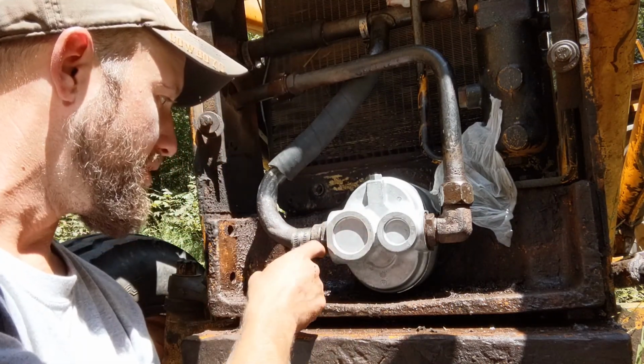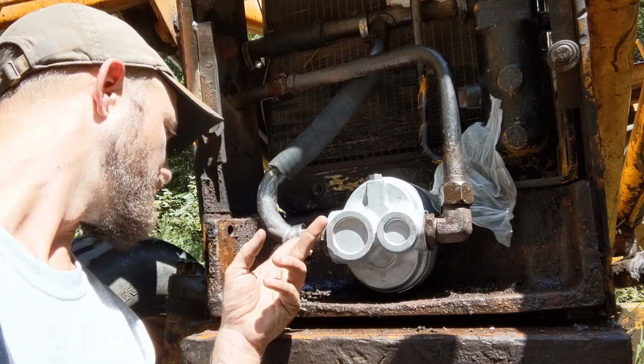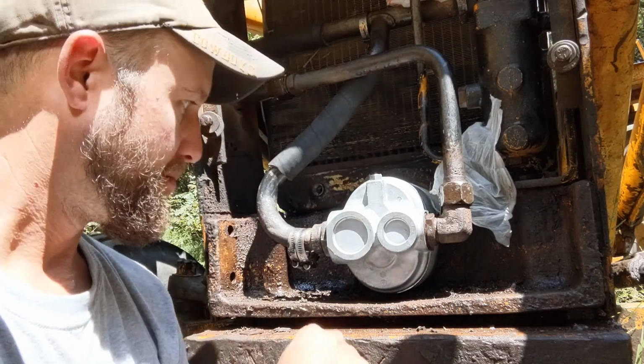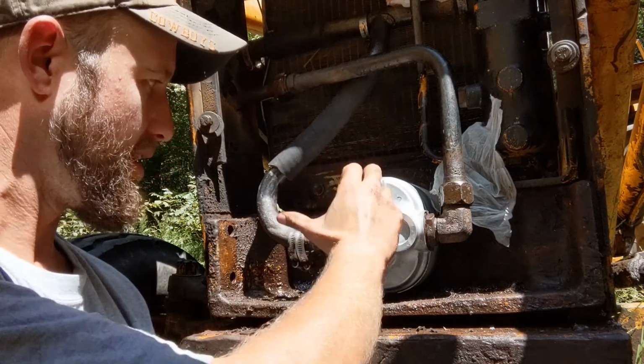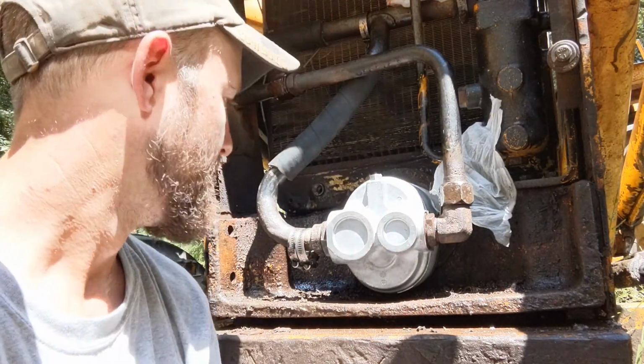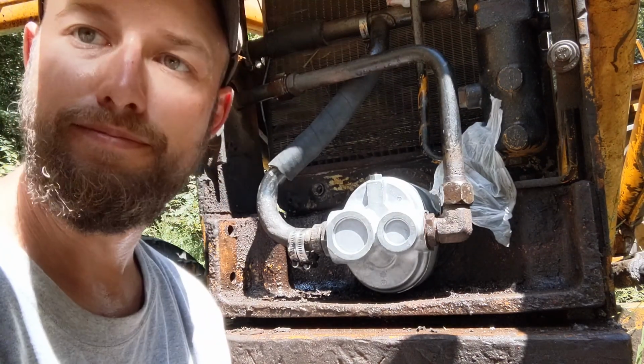And actually on the discharge side, well, no, that's not true. This whole thing does have to turn. But anyway, you could loosen this up, and then that will turn freely and gives you some more flexibility when you're trying to get that suction line off of there. So, all right, we'll put these hose clamps on, and this is going to be done.